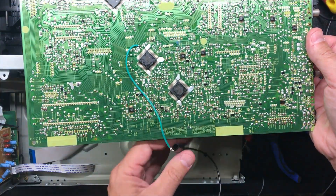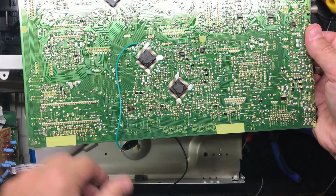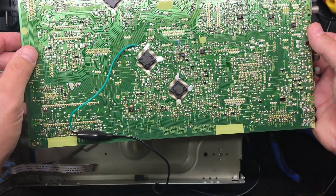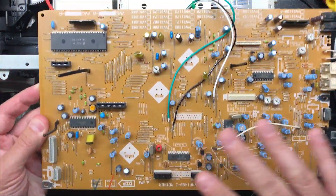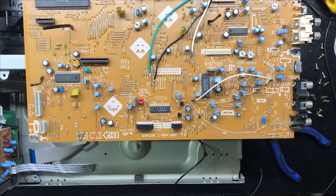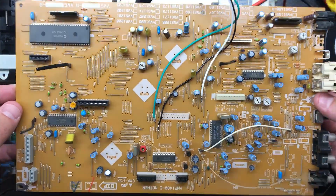This does not go to IC 802 — integrated circuit 802. We're looking for pin 43 on this integrated circuit; that is what gives us digital audio out. What I did was solder a lead on there, put it on an alligator clip, hooked it to my multimeter, and tested — it did not ring out. So that tells me that lead was not passed up here like I thought it was.